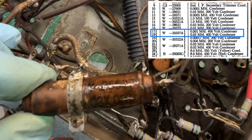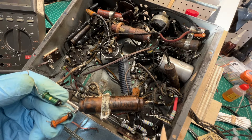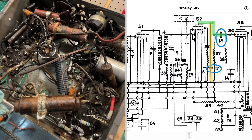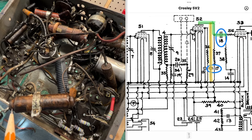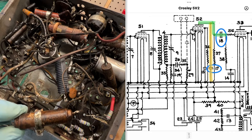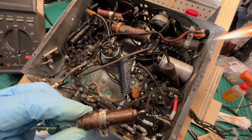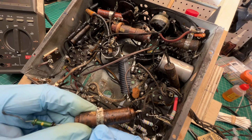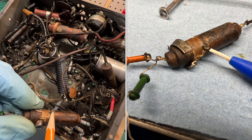You can see the resistors attached directly to the capacitor. I'm going to clean that up. I've mounted a terminal strip at this location — number 38, number 56 — so that's my junction point back to C18. This being a dual cap, the strap itself was attached back to the chassis, so the other section of the capacitor internally — let me pull what's left of the strap off. You can see the other lead for the capacitor.